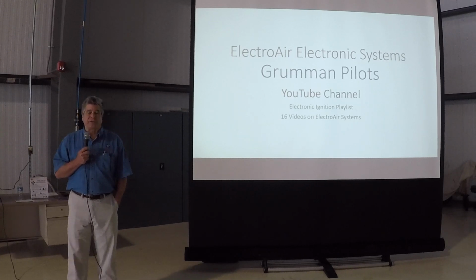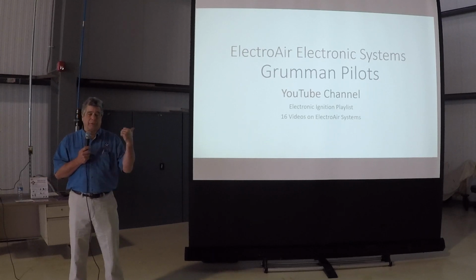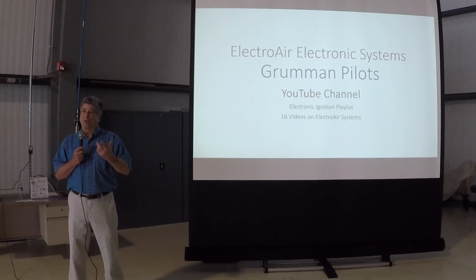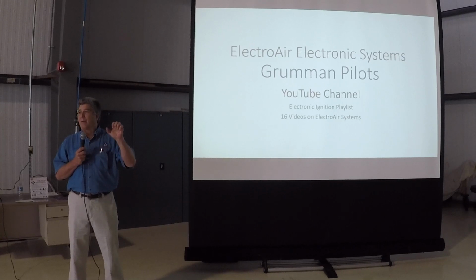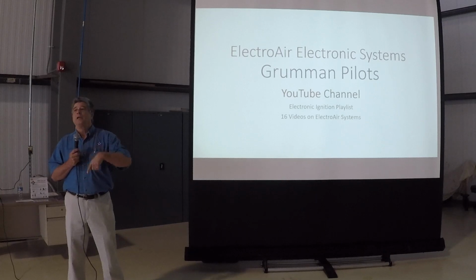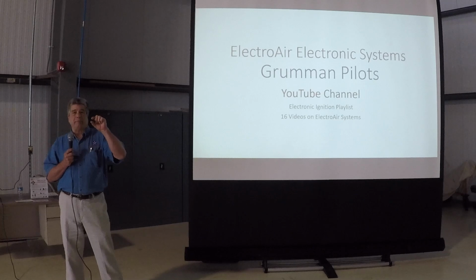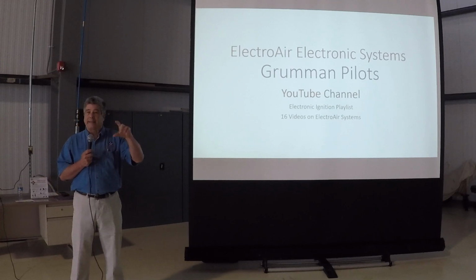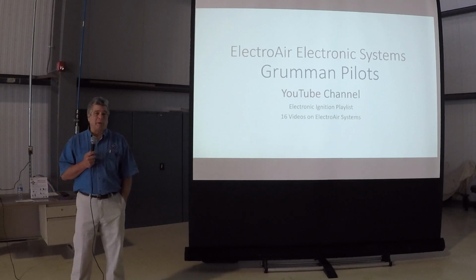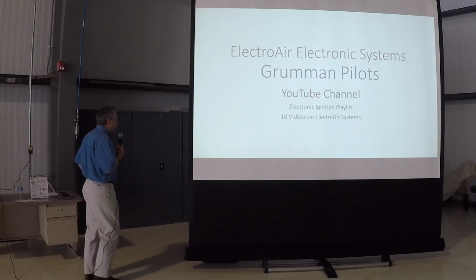And when we installed our first system many years ago, I've been doing this now for over 5 years with ElectroAir. When we did the first one, after we had it all hooked up, we pulled the spark plugs out of all the cylinders and we hooked up on top of the engine, one plug being fired electronically, one being fired by the magneto, turned out the lights in the hangar and cranked the engine. What we saw was the little blue pink magneto spark about a millisecond going tick, tick, tick, and we saw a bright blue pipe cleaner hanging in midair on the other spark plug. Now that 70,000 volts does cause a couple of problems for you if you try to use normal spark plugs.